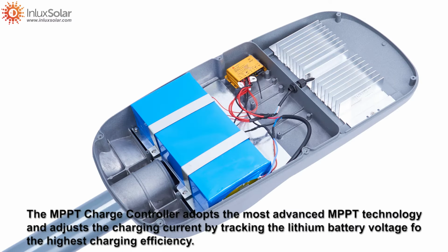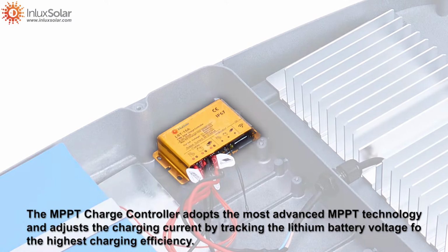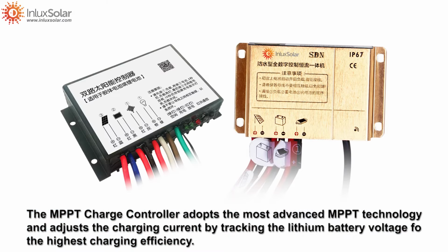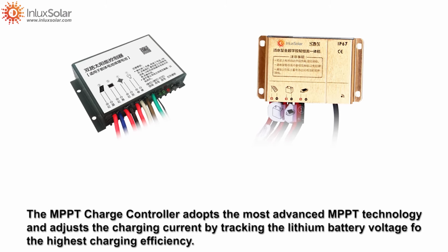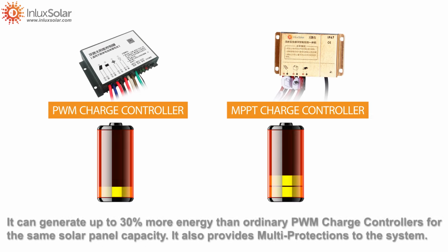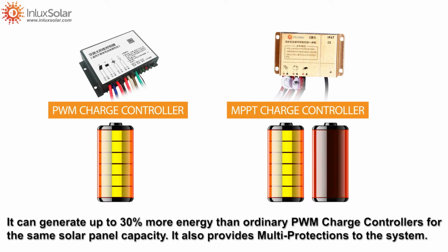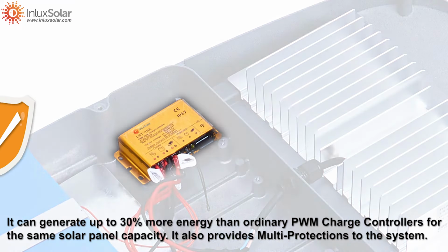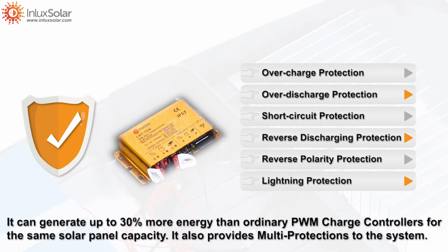The MPPT charge controller adopts the most advanced MPPT technology and adjusts the charging current by tracking the lithium battery voltage for the highest charging efficiency. It can generate up to 30% more energy than ordinary PWM charge controllers for the same solar panel capacity. It also provides multi-protections to the system.